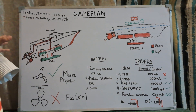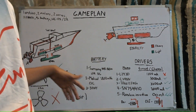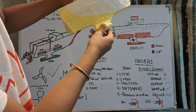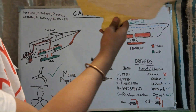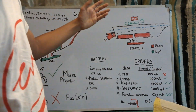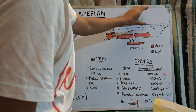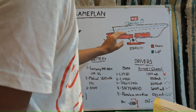This is what I think the basic layout should be. Usually all the heavier things should be at the bottom to keep the entire thing stable. I've kept a random weight at the bottom, and whenever waves try to tilt it, the weight pulls it back to a stable form. The nine-volt battery, even though it's heavy, will stay in a waterproof box above the midline.